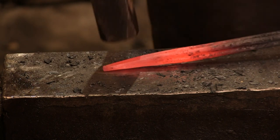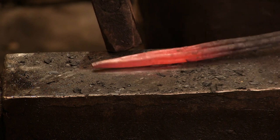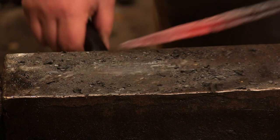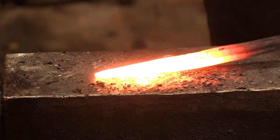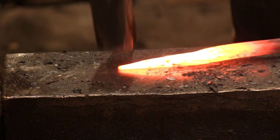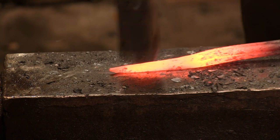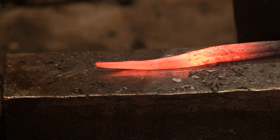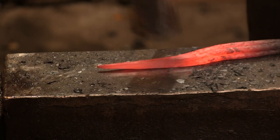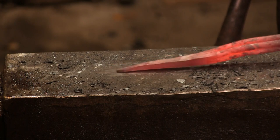You can see that pulled out pretty nice — you can still see a little bit of a seam, but that tip hasn't split, which is very common when you're doing this. It's looking pretty good. We'll take another heat and continue to draw this out. We've got to have about two more inches on that before we're ready to go. Here we come with heat number two — all right, good second heat, let's go for number three.